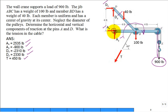And that's why this AY, look at the value of AY, it's negative 900 pounds. It's having to hold it down. And if the pin breaks, it can't support it by pulling it down at a magnitude of 900 pounds. Hence, the member rotates, as you just said, clockwise. So things like that.